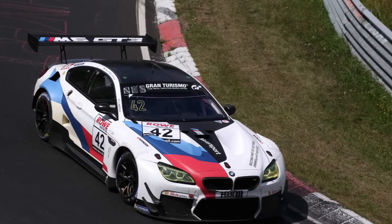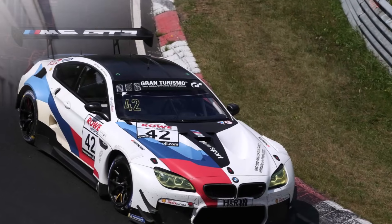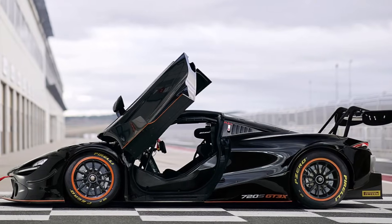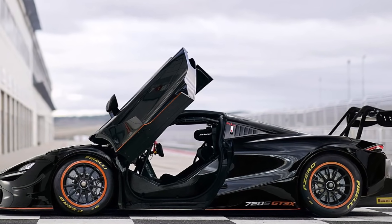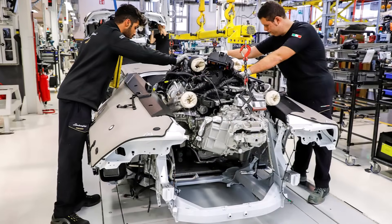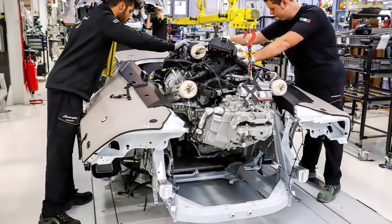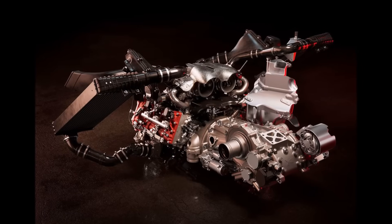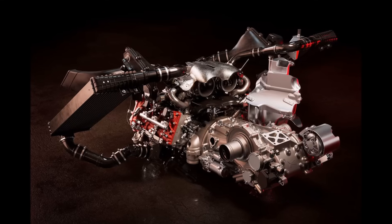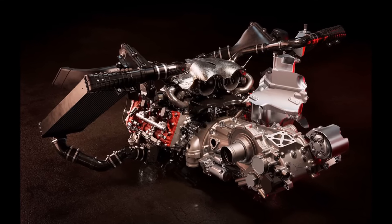But this is changing right now. Turbo engines provide a lot more torque in areas you want it, you can fine tune them, and because of that boost, you can use smaller engines to have a better package. That means the old packaging problem of mid-engine cars — the gearbox hanging behind the rear axle and blocking a large diffuser — can now be solved. Ferrari's 296 has a short longitudinal V6 but a transversal gearbox behind the rear axle, which allows for a large diffuser.